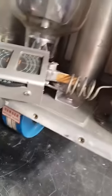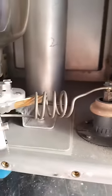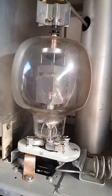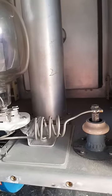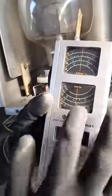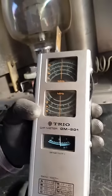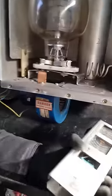We'll adjust the grid afterwards. This is a used valve that isn't working, so once we put a new valve in we're going to fine-tune the grid to hit 46 megahertz. Right now we're closer to 45, so it just needs a little fine tuning — very easy to do. And that's how you measure frequencies. You need these measuring instruments, but that's how it works.